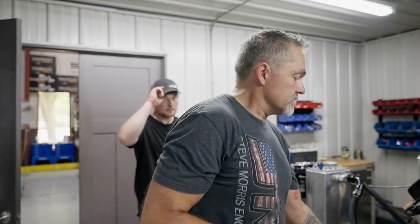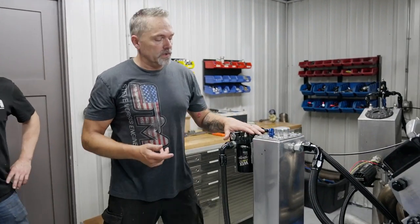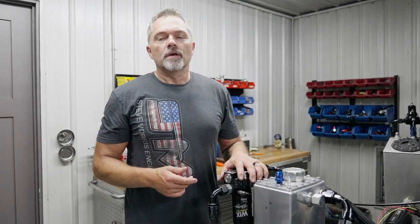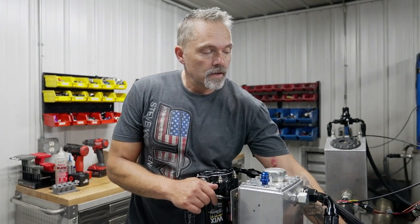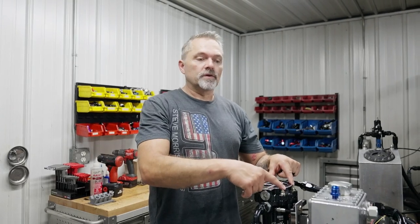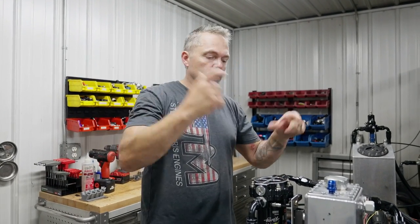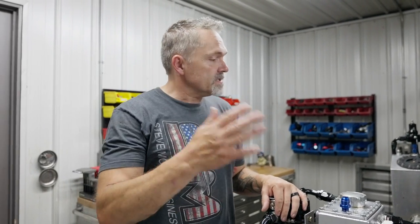You've seen, we got Garrett's engine on the dyno. I had to change some lines around a little bit just to make it fit the dyno. And what we're doing right now is priming the oil pump, gonna prime the oil system, and I put the Clearview oil filter right here. So we'll run this thing, and then we're going to take this filter right off, look at the filter, bada bing, bada boom, all done. So everything's all set and all good on here.